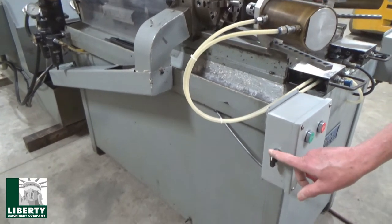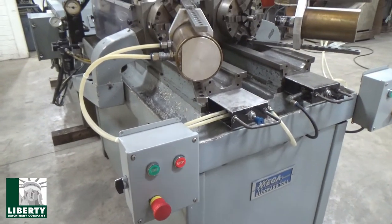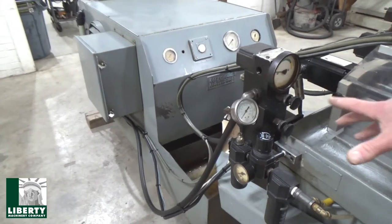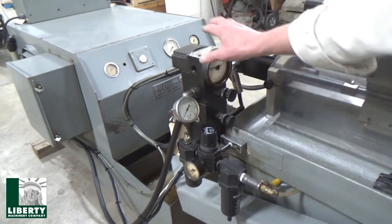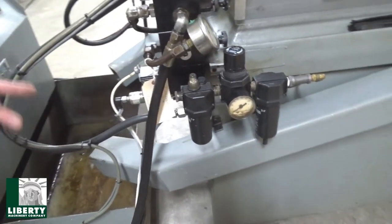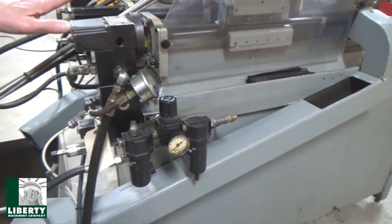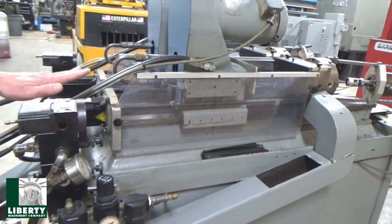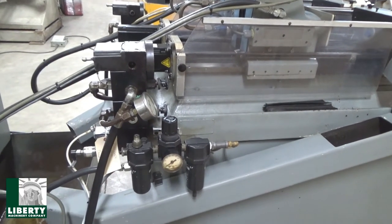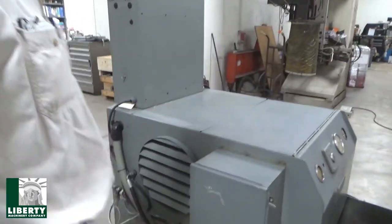Except for these push button stations — the jog switch right here, and this start/stop for my auto cycle. When we're ready to go and I finish up on the panel back there with our numbers, we'll just hit cycle start once the piece part is zeroed. The flow minder kit — one small difference — they're not using the flow minder wiring because they put these transducers in here which monitor, back to the control, the high pressure and the low pressure. All those parameters are set at the control, which is what the flow minder used to do. This watches the pressure going up to the gun drill. We're not going to run the spindles real long — we don't currently have the lube line coming up into the spindles, but for a few minutes we're fine.